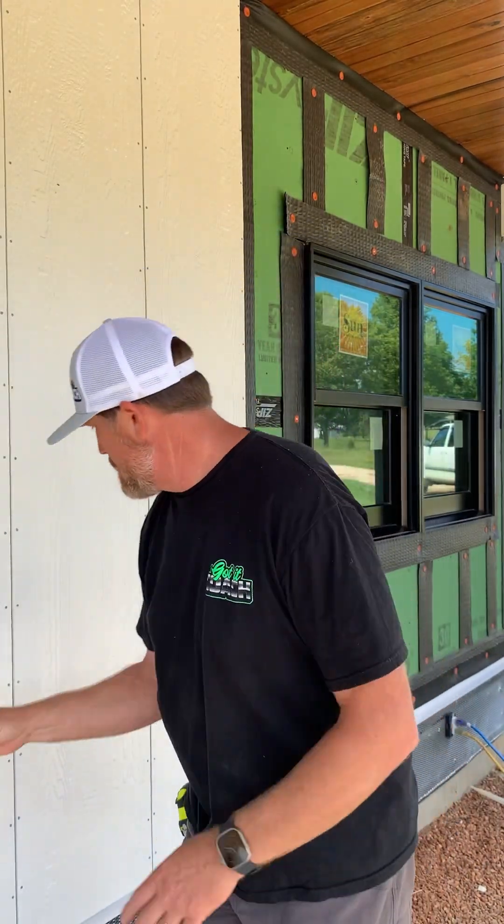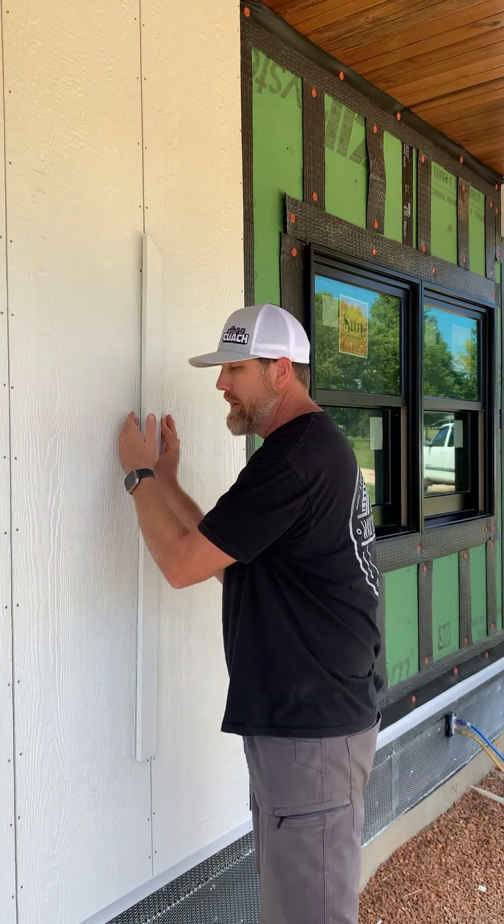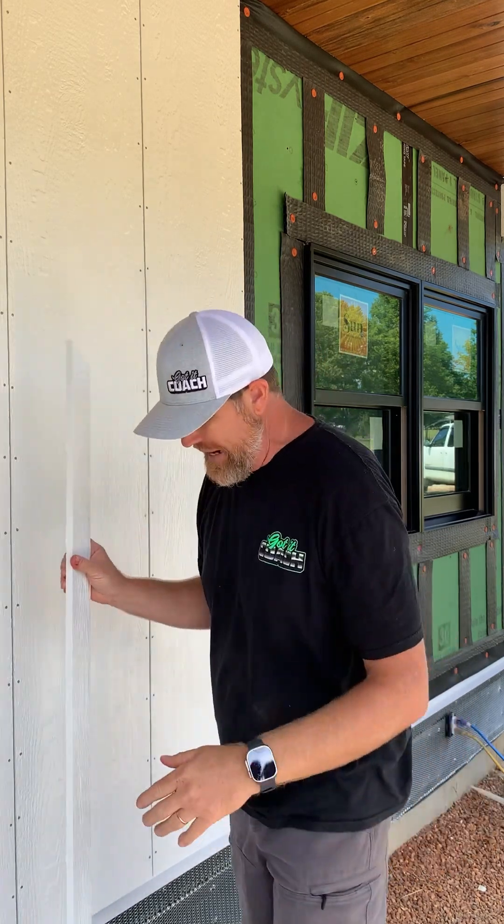So that worked out better than I thought it even would. If you're building a new home and you're going to be installing a wood type siding or even a fiber cement siding, the Zip System rain screen would be very beneficial to that system, especially like what we got here — a vertical board and batten. Once we put the batten on, I'm not going to caulk this joint. Water can blow in and potentially get in behind the siding. But now since I have the Zip System rain screen, I've got a quarter-inch air gap behind it — water can drain out and dry out over time and not create moisture problems and rot from the inside out. I'd probably just contact your local Huber dealer that sells Zip System or Advantech — they should be able to get in contact with Huber and find out when you can purchase the Zip System rain screen.